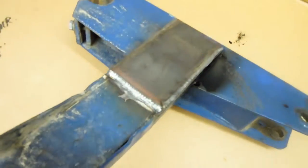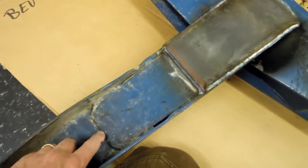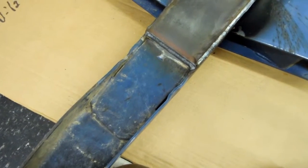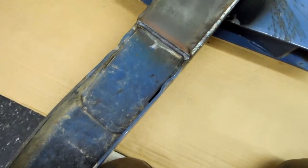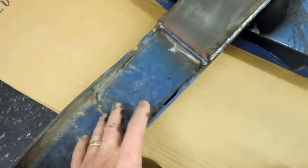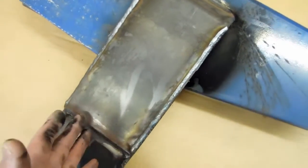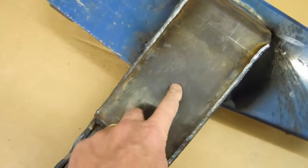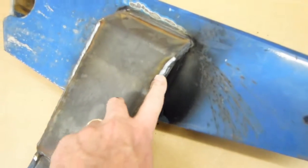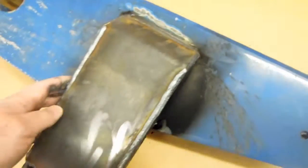On the other side is where the real repair was done. This is really a hollow channel right here, and you can see the factory plate that was installed — very thin metal by the way. The loader is rated at 750 pounds — capable of lifting 750 pounds. I don't even know if I've ever had 750 pounds in this loader because it's used for cleaning up around the barn, moving wood chips in spring and summer, pushing around a little sand. Anyway, this is the factory plate. What the repair shop did, after straightening of course, they replated it with a pretty heavy piece of metal and then stitched it along the seam. They did a good job. I told them it was worth it to me — I didn't want any quick little tack job. They put a nice bend to follow the original profile and stitched it all the way around. They did a very nice job.